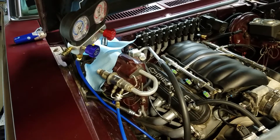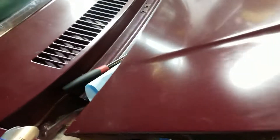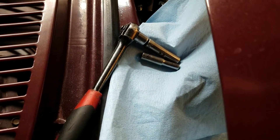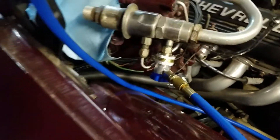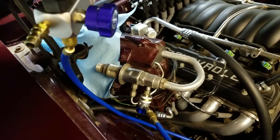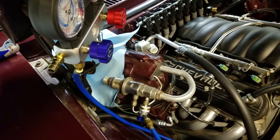This is a POA valve and I've been taking a ratchet wrench here with a 3/8" and a 7/32" socket alternating to loosen up the lock nut inside. It's hard to see on video but it's inside the back of this fitting here. You can loosen the 3/8" lock nut and then use a 7/32" to turn the little tiny adjustment screw in there.